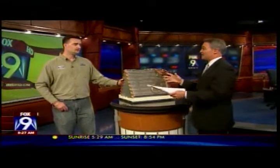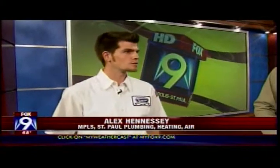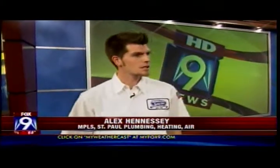As a homeowner, we don't get into this part of it — we wouldn't check to see if this was clean. So the question is, when do we call you? If your house isn't cooling appropriately, if it's just not getting to where it should be, then you can call us. Right now we're running a special for $89 where we come out and professionally clean your outdoor unit. We do some diagnostic tests and see if the temperature differential is where it should be — we like to see between 16 and 21 degrees of cooling from the air in your house to what comes out of your furnace.